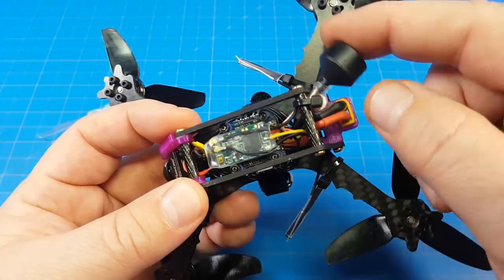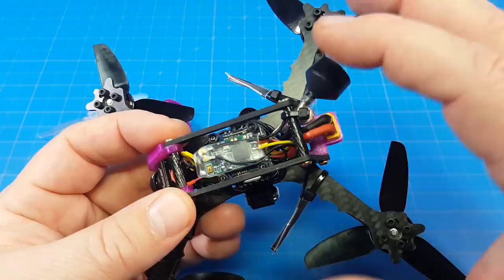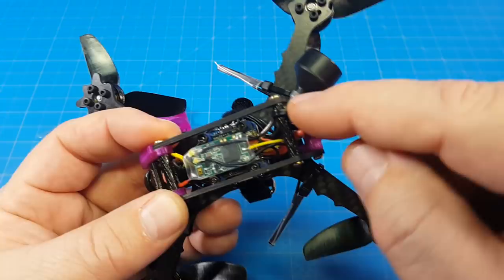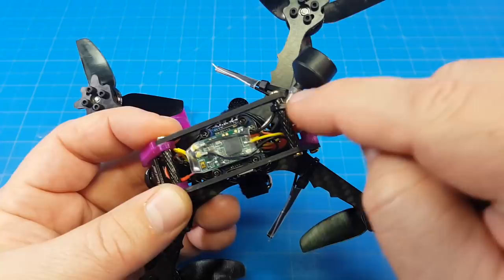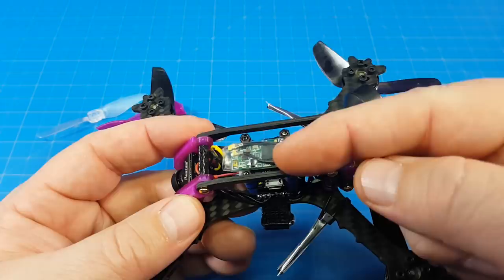Doing this, I had to make sure my lead was the right length and that it was flexible enough to get down through there, because I also wanted to route my antenna through here. I wanted to use a circular polarized antenna rather than a linear one, to see what that experience was like tumbling through a tree with this unique style. So in order to shorten it, I coiled it, put some heat shrink, then poked a hole in the heat shrink with my soldering iron and put a zip tie through it to secure it down, so that if it were to get caught in a tree it would hang without putting stress on the UFL connection.